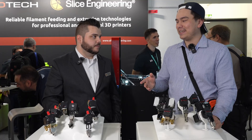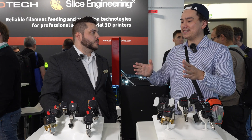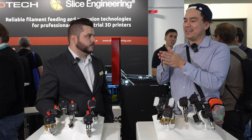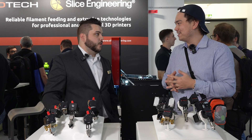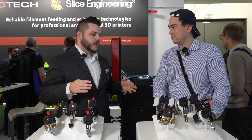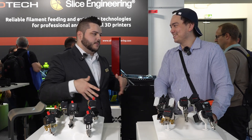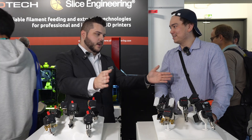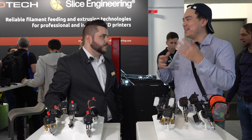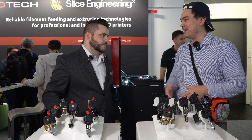So that vase mode nozzle has a 2.4 millimeter diameter. As far as I'm aware, I have not seen a nozzle that does that — expanding to such a large outlet. You'd think your filament is 1.75 millimeters, so how do you get that to expand out to 2.4? I don't know the exact engineering behind it, but I think it's a similar sort of thing where it's narrowing and then expanding back out to that 2.4 millimeter orifice. That tapering down helps it simulate acting like a smaller diameter nozzle, but it's still able to expand back out and make a nice clean print.